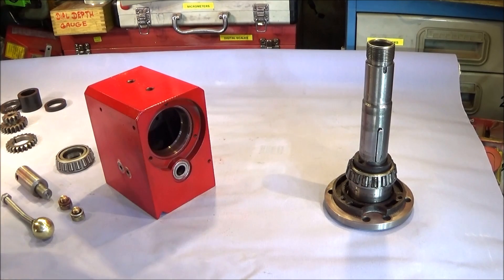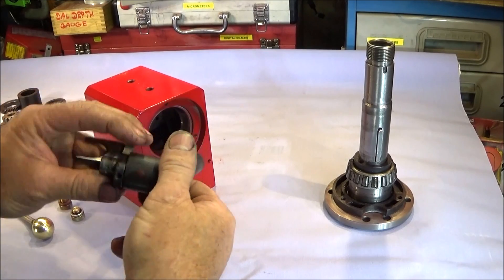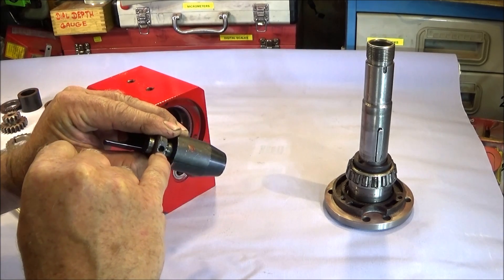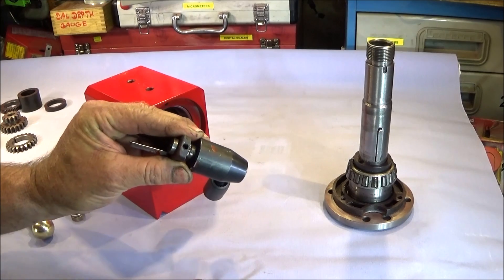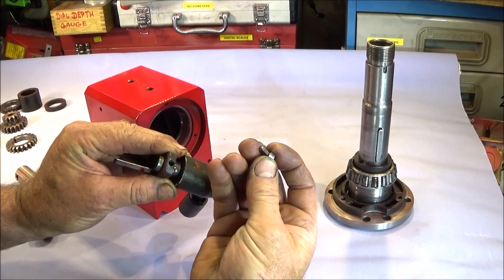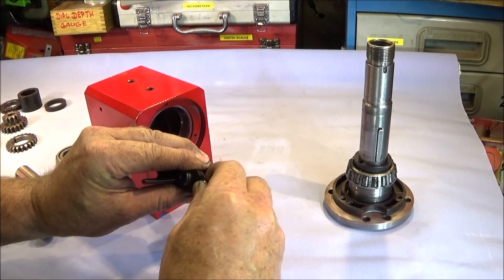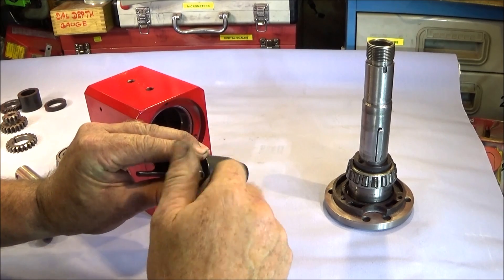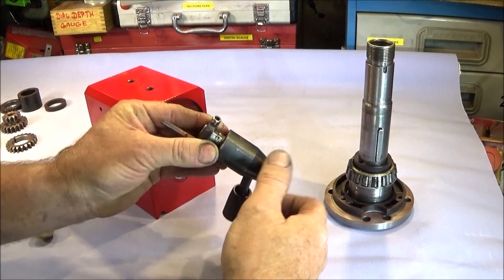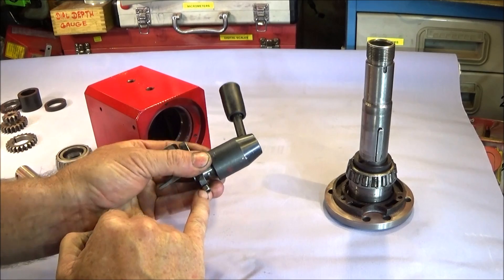It's quite a pain having to strip the whole lathe down just for such a small fault, but that's how it is. To overcome this fault, you remove the slotted grub screw and change it for a stainless steel allen bolt cut to length with a point on the end which goes into the indent. With the allen bolt you can get a lot more torque on the screw with the allen key and do it up very tight so that it cannot come loose again, and there's enough room in the lathe to allow you to do this.